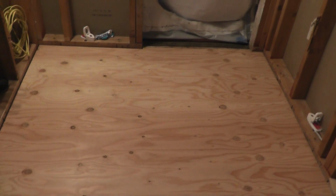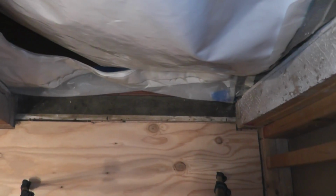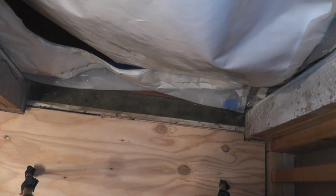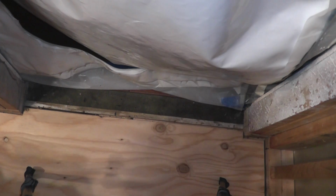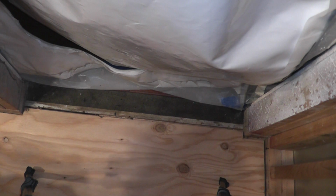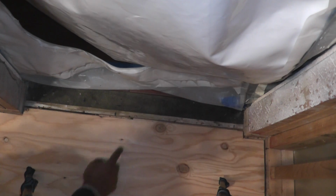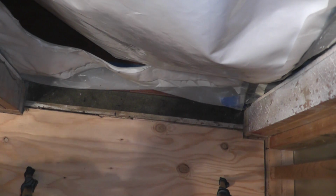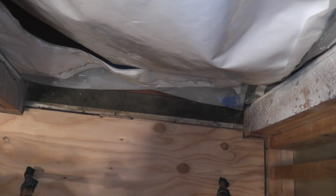And so what I'm going to do now is go closer to the doorway so you can see the cuts in the doorway also. Right there at the doorway, I've got my 1/4 inch gap for expansion and contraction between the 5/8 inch plywood and the 3/4 inch plywood. What was most important was to make sure that the width of this section of plywood was a 1/2 inch less than the actual width of the doorway, so that I have a 1/4 inch on either side.